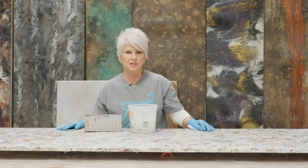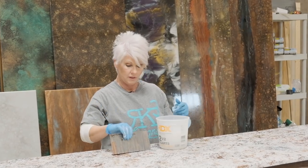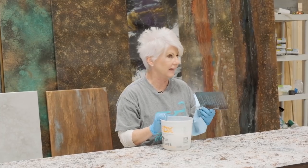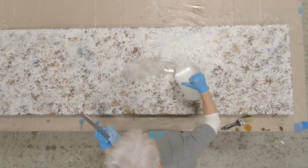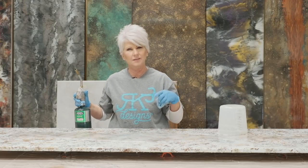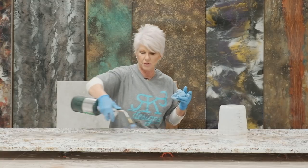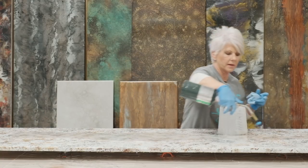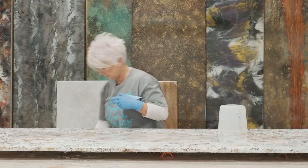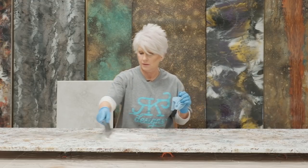We let the spray paint dry overnight. I'm going to finish this project on my own — Emily had to go to work. I'm going to use 48 ounces of Stone Coat countertop epoxy, clear, with nothing added to it. I like to heat up my epoxy before I trowel it — it's a little cool in here this morning and it just helps it trowel out a lot smoother. So I just barely hit it to warm it up a bit, then I'm going to trowel with a one-eighth by one-eighth square notch trowel.